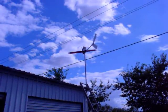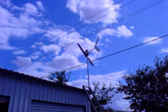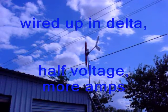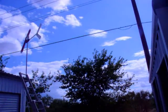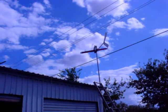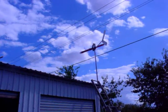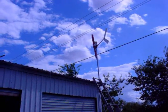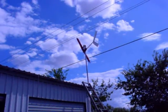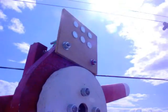I just went to the truck to get the camera. Been a few days fiddle-farting with this — I could show you a few differences on things that I did. Right now it's wired up in Delta. The tree isn't doing anything, it might die out — it's what it's been doing all day, just spinning up and then dropping back down. I did see five amps out of it on a little gust. It's about five o'clock in the afternoon.